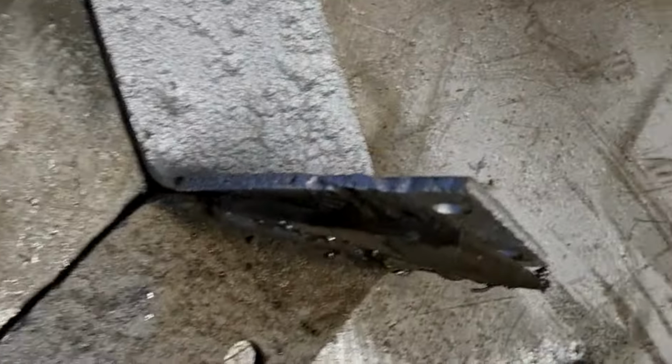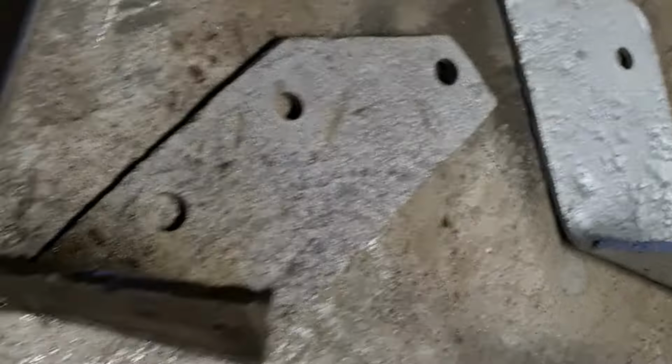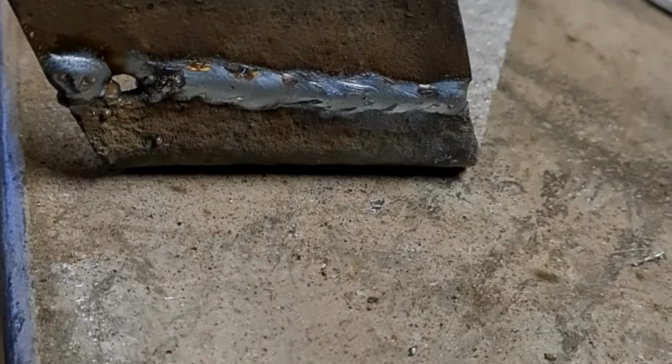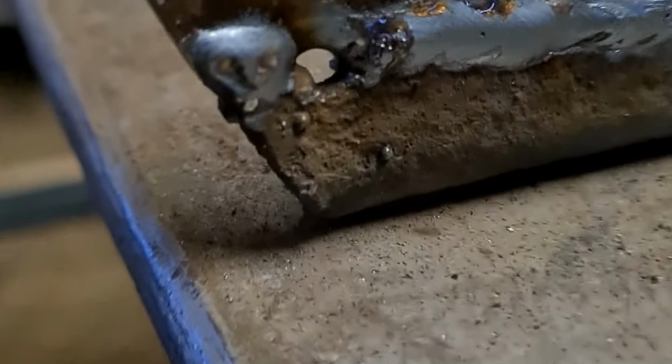So this is the foot plate bracket that was broken. I've just welded the piece on it. I'll get hold of it, it's pretty hot. And the bit is there, look. And I've just got to drill the 3 holes in. And I'll put them back to back so I get the locations right. And it's already got half a hole in there.